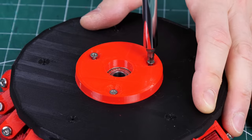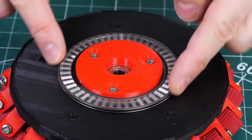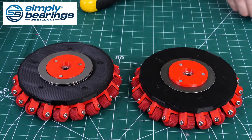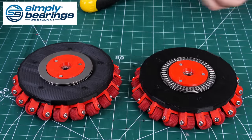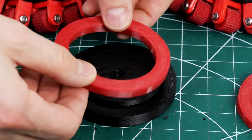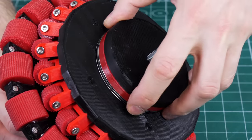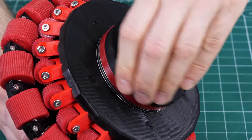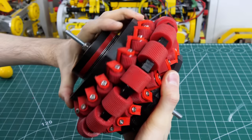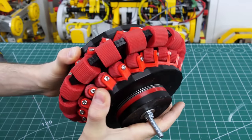On the outside of those bearings I've got a couple of hubs which are just screwed on to each of the powered hubs, and those are to align a thrust bearing. These have a row of little pin rollers that go all the way round and then two pieces of metal either side — thanks to Simply Bearings for the bearings for this project, check out simplybearings.co.uk. These take quite a lot of load in the direction that's going to push the hubs together. The next part is another TPU bushing which fits onto a cap, and those go on each side so I can apply tension to the thrust bearings and ultimately push the two powered hubs with rollers together. These just do up with a lock nut so I can get the tension just right.